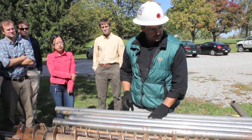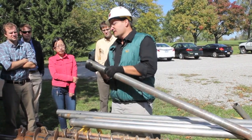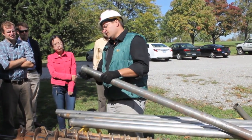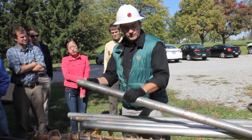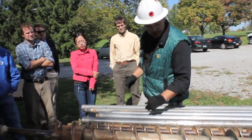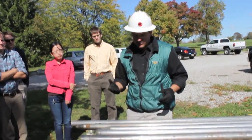These are good for getting cuttings. This is a 2.5-inch core barrel, and we have several cutting bits for harder materials, hard pans. This one was used in gravel, so it's kind of worn off. We don't rotate too much. What we really like to do at the beginning is a direct push — that way you get relatively undisturbed continuous core.